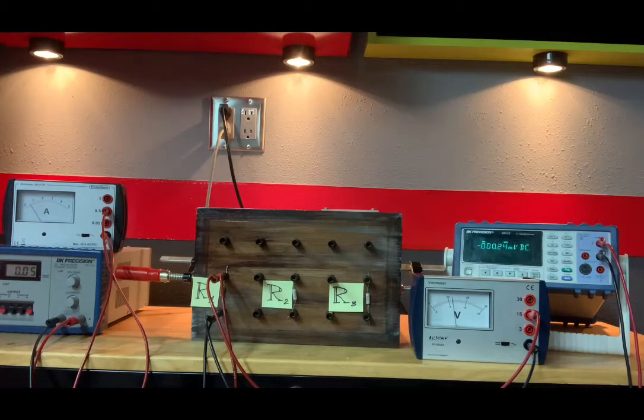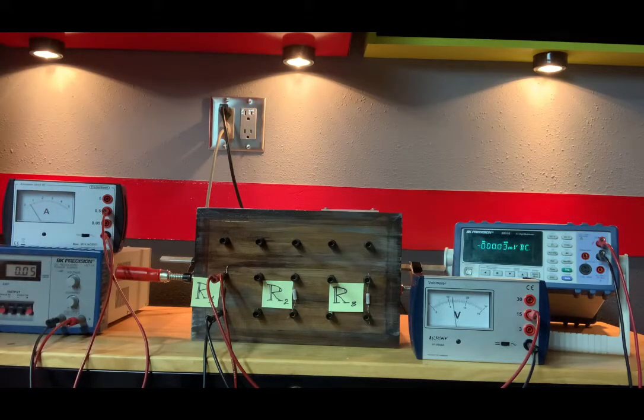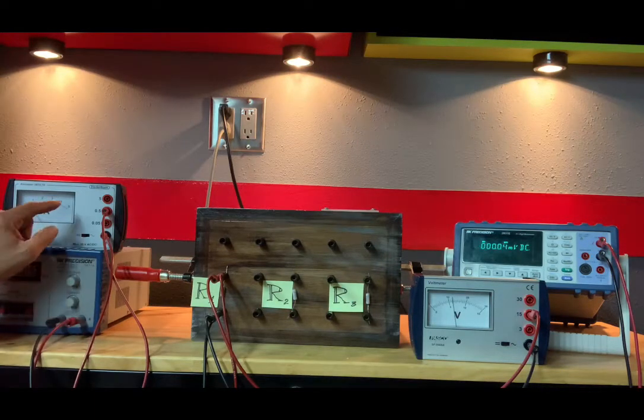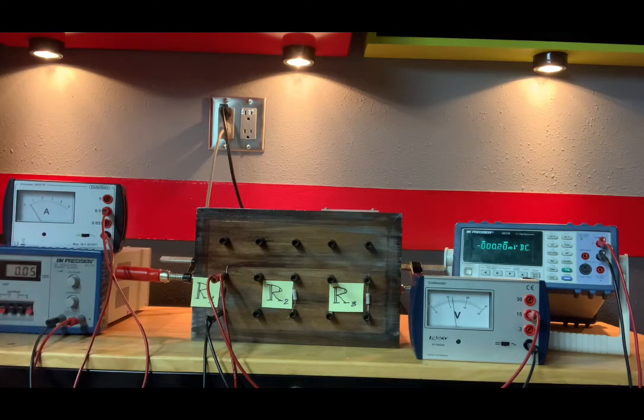If you look at your table on page 25, let me go ahead and help you fill that out. On the top of that table, it says nominal value. The nominal value of this resistor is 110 ohms. And for I1, the value of that we just measured, it is 0.053 amps. The scale that we are on is the 0.5. And now we need to write down the error associated with this measurement. When we're on this scale here, the error would be 0.005 amps.